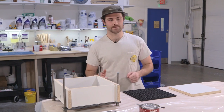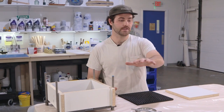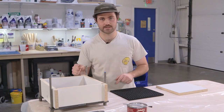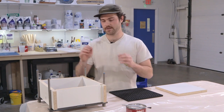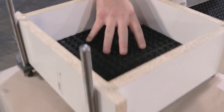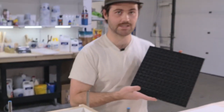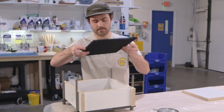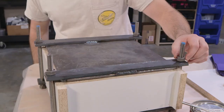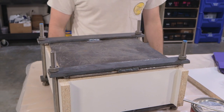It's time to get the layup started. Jeff and Skip are gonna be helping to wet down the 250 pieces of cotton that are gonna be going into this mold. They're gonna be wetting them out. I'm gonna be putting them in here and making sure that they fit nicely on top of this positive die. Once all of those layers are down, I'm gonna take this die, the negative, put it down here. This melamine block will go on the back. We might need to make a few spacers, and then the top goes down and we bolt it all together.